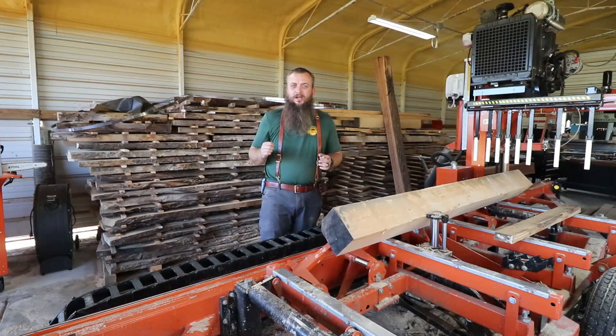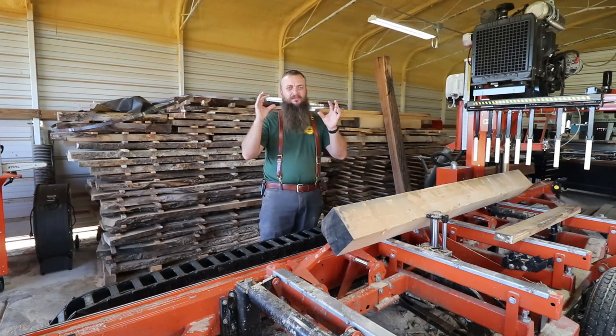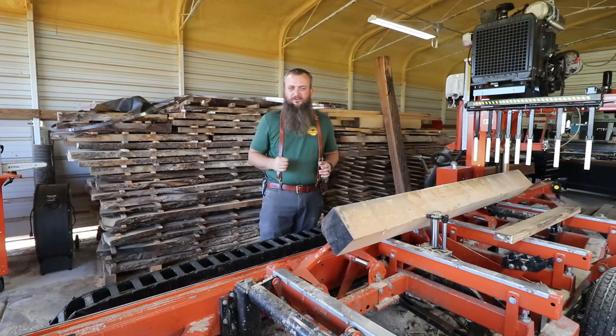Quarter sawn wood does not move much at all. The width of it on the medullary plane moves just a little during seasonal expansion and contraction, and even during kiln drying; the thickness moves more. So that's one reason I like making tables or farm tables out of quarter sawn white oak, or red oak rather. It really doesn't matter.